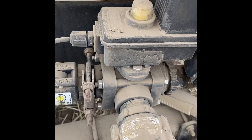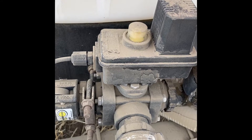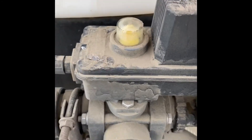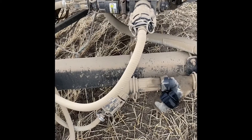That comes back into a three-way switch. There's a mercury switch on the drill that tells it when it's either in the ground or out. It gives voltage to this switch - right now the drill's out of the ground so the switch would be closed, and when they set it back down it would open back up.